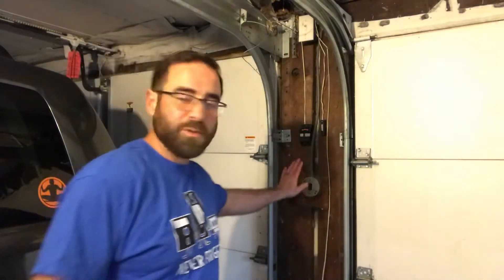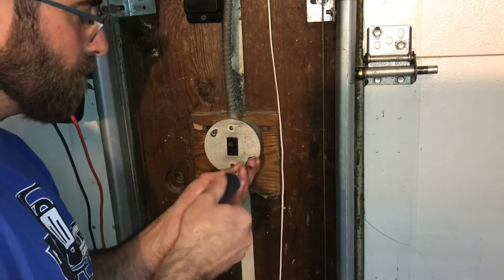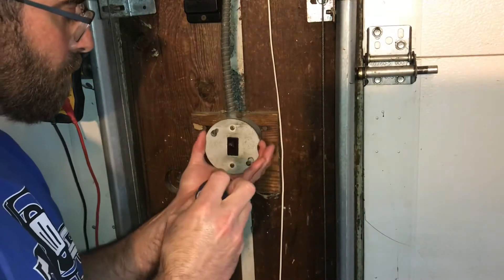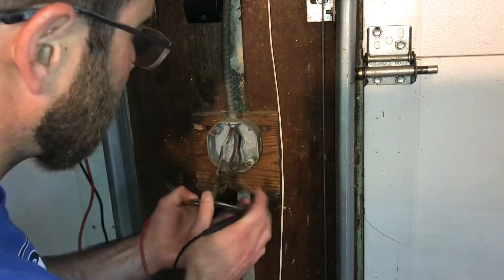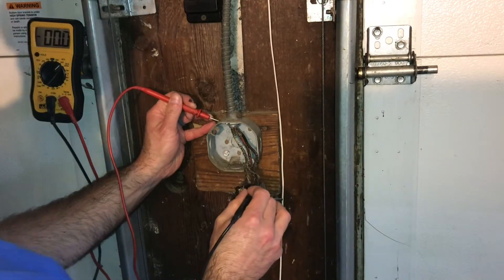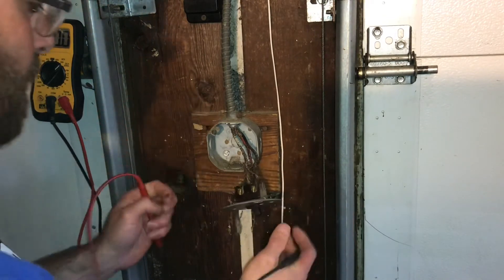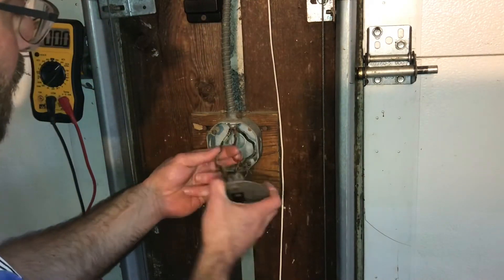The lights that this switch controls are actually off, so that's a good sign. Before I touch any potential live wires, I'm going to check with the multimeter. I do have a couple outlets still on so I have some light, but I'll keep the headlamp handy just in case. Because the box is the ground, I'm going to try to make a complete connection to any of these, and if any of them are live I'll get a voltage reading. I need to figure out which one is the live wire and which ones are the travelers that go to the other switch.